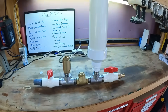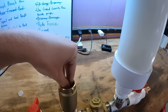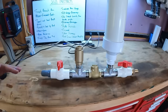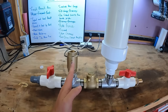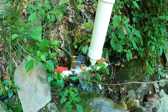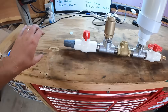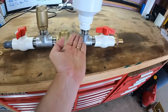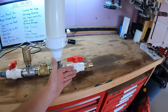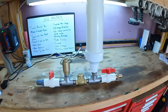There are really only two moving parts in here that are used to power the water — two check valves. The first one: from research I've done, a spring valve is better because it gives you a little bit more back pressure. Your head pressure comes down and has nowhere to go but up to this spring check valve, which is held open by the spring, allowing the water to rush up and out. As the velocity of the water increases, it slams the check valve shut, causing a back shock. That back shock forces the swing valve open, starting to accumulate pressure in the pressure tank and build PSI, which gives you the ability to pump water uphill.